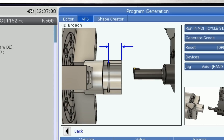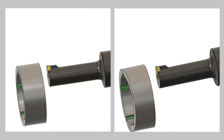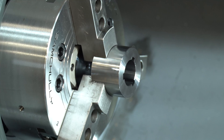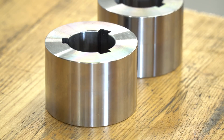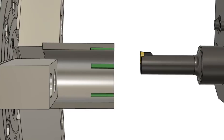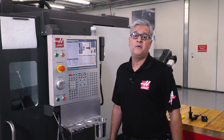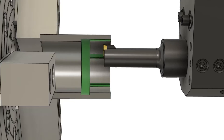The next line we will enter the depth that we need to broach this part. To achieve optimum results, these inserts work best when they are centred and perpendicular to the workpiece. They also like to exit the cut to a parallel face, so if the back of your blank is raw stock or not positioned true then the insert may chip much earlier than you would plan for. If you are running this on a first operation with raw stock, we suggest moving the broach operation to the second operation, where the jaws are bored and the blank exit face is parallel. If this is not an option, you could use a back face tool or a groove tool to machine the back surface square before broaching. Do not under any circumstances broach all the way to a solid face, as these inserts are designed to push the chip forward and not evacuate them away. When broaching to a face on the OD or the ID, a groove or cavity would need to be machined at the end of the broach keyway so the chips have an exit point.